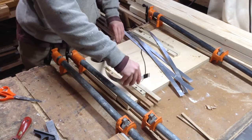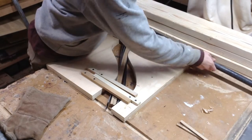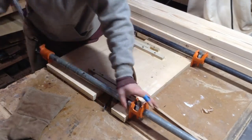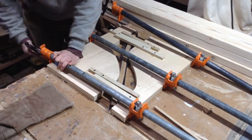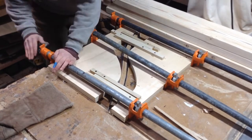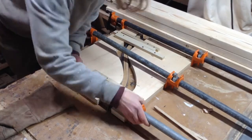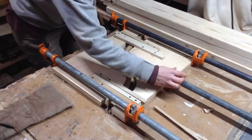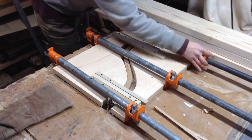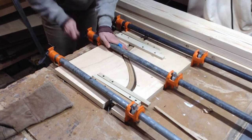For my metal strap I used some flashing pieces clamped together - there are four on each side. My method was to put that wood in there, flank both edges with the metal, and then use pipe clamps to clamp everything together. I use pipe clamps because the clamping action - it's a screw with a handle - is much faster than C-clamps or any other clamps I have, and I could gradually just apply pressure to all three of them. I perfected this method a little bit after this first bend and then slowly got that wood to take shape in my form.